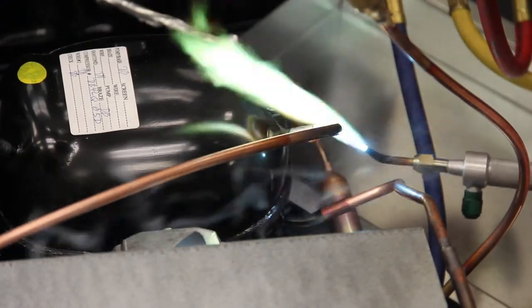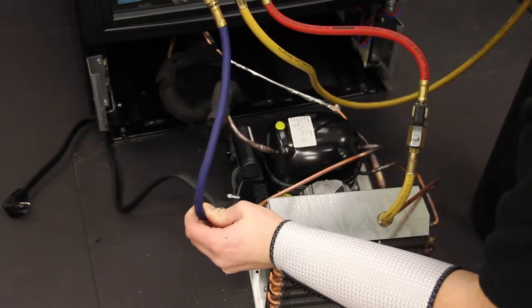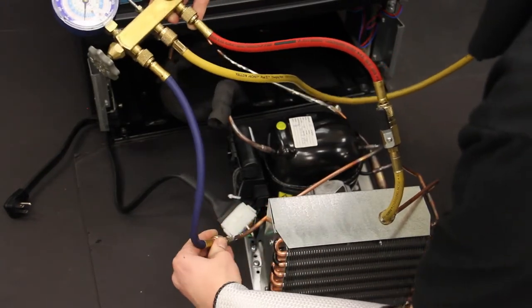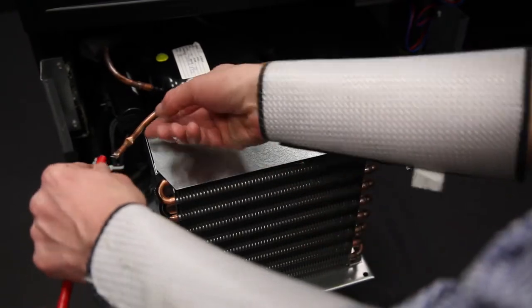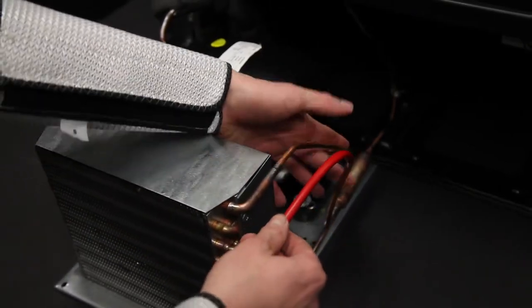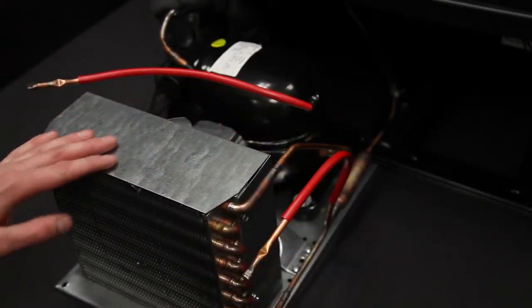Once the compressor is brazed into the system, all of the following steps are the same as you would take if you were replacing a compressor in a 134A or 404A system. Once the final repair is complete, be sure to reinstall the red identifying process tube sleeves. This can be done once the process tubes have been pinched off, brazed shut, and have cooled down.